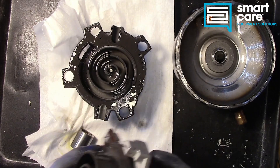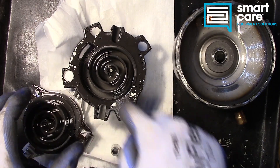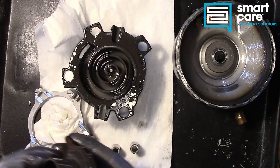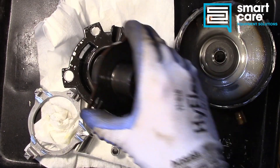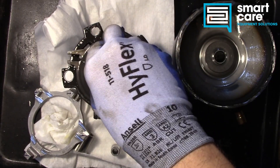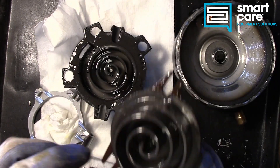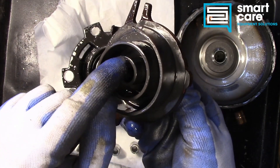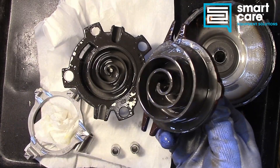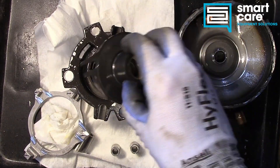That area also has oil in it during operation. Inside the spiral path, we're creating a continuous squeeze with the refrigerant. It enters from a little port at around the 11 o'clock position. As the scroll moves around, it creates a difference in volume through the spiral path, then pushes the high-pressure refrigerant out through the center of the top piece.